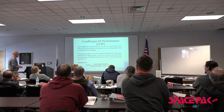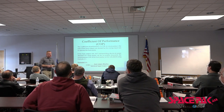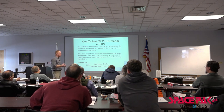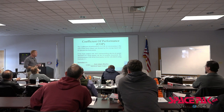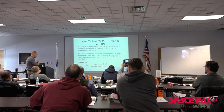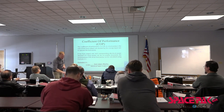You always get the question, how do our heat pumps, our chillers, compare to a ductless split or any other air conditioning unit? What's their EER, their energy efficiency rating, or their SEER? Air-to-water heat pumps do not have that kind of rating. What we do have is a COP, or coefficient of performance. And basically, that's heat output, BTUs per hour, divided by our electrical input, okay? COP, as easy as stated, says that I give you a dollar.